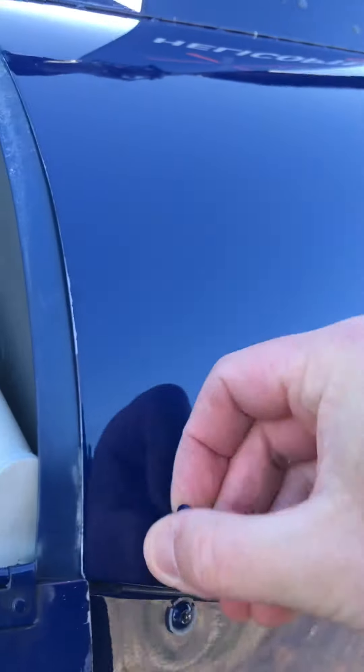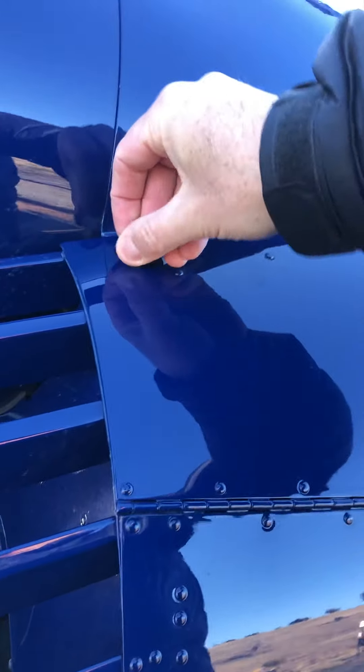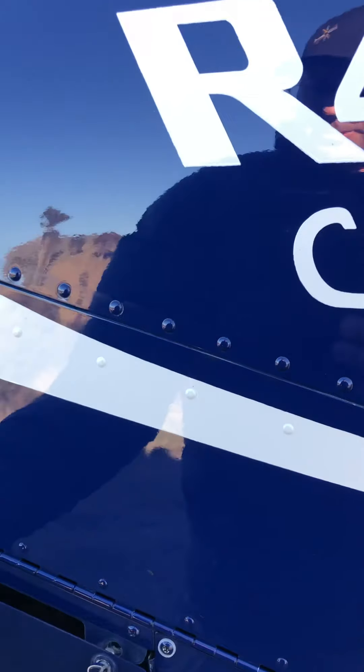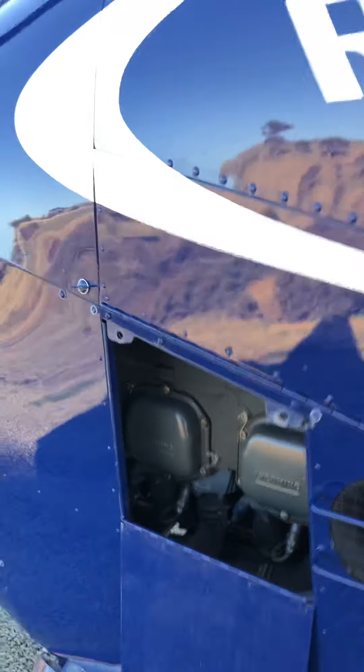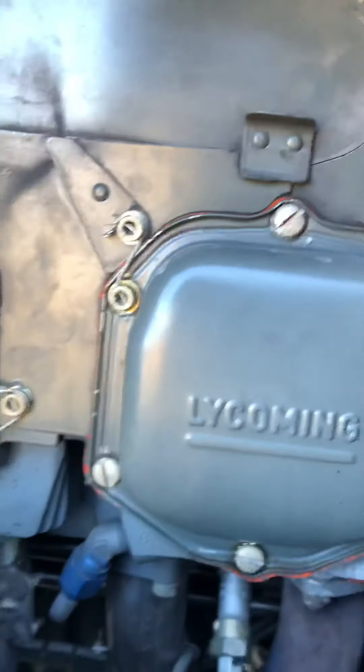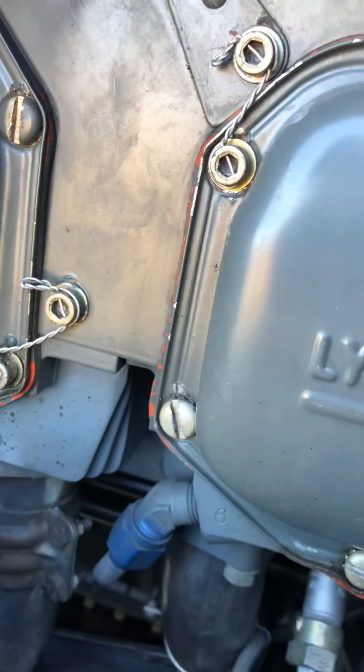I'll do all this back up, make sure they're secure. Coming here to the right side of the helicopter — but actually the left side of the engine, because the engine is mounted upside down. We check the wires in here, that they're all latched in — that stops the nuts vibrating loose during flight. Check that's all good and the inlet is clear.